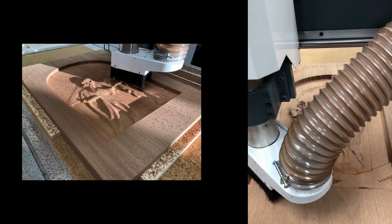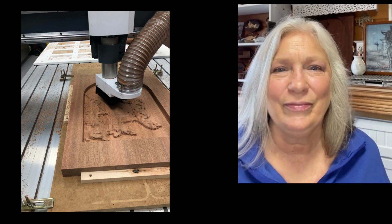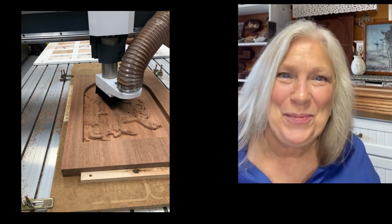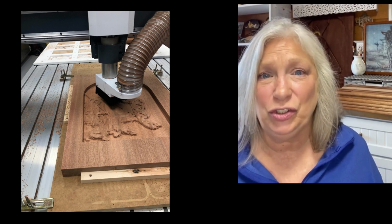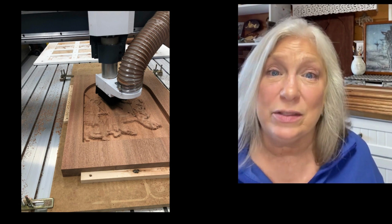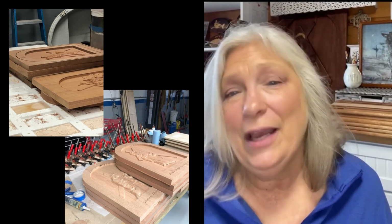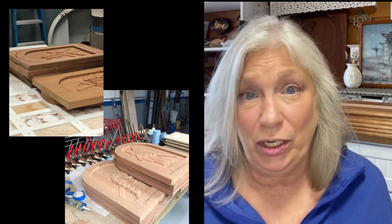What comes out at the end is something that then needs finishing and detailed work, but the major carving pieces are done. So let me show you a little bit of what that looks like. And while we are moving quickly through the whole process, the actual carving takes up to 12 hours for the machine to do, because it's such a complicated design, and we want as much detail as the machine can do. Once the CNC machine has done its work, Rich does an overall rough sanding of the whole station.